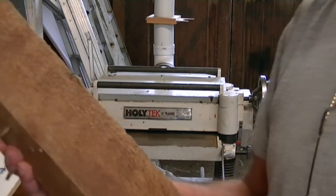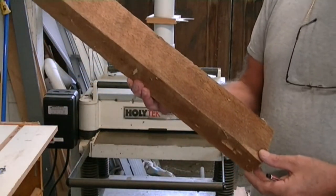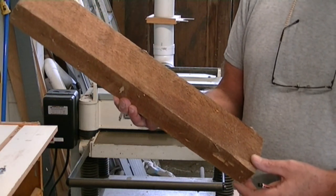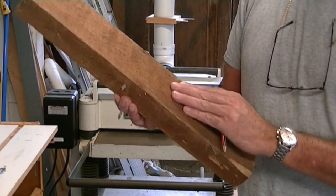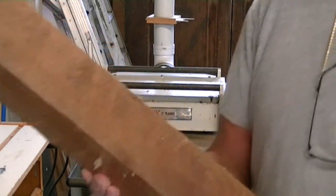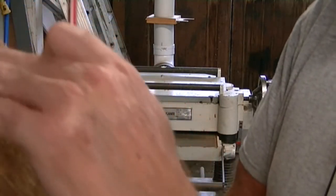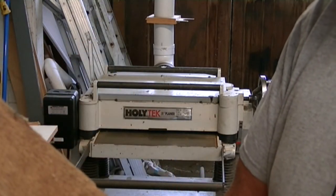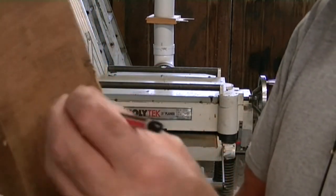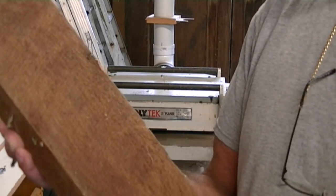Okay, wood. We use it all the time. But you know, there's a number of things we want to know before we put it through. Normally, before you even put it over a jointer, so they've got a flat and a 90-degree edge, I will look at it. Especially on this, some very old coarse grain, you can see the direction of the grain quite clearly, and so on that I'll mark an arrow on the two edges.